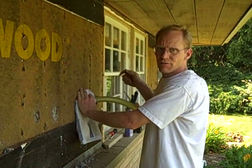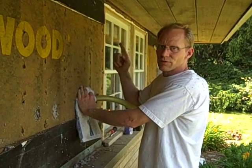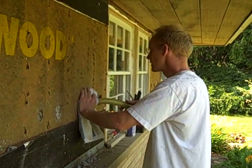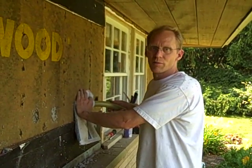We drill, fill all the way down up to the middle, and reinsert the hose up and fill from the top down back to our hole in the middle. A full cavity like this, 16 inches on center, takes about 4 minutes start to finish.